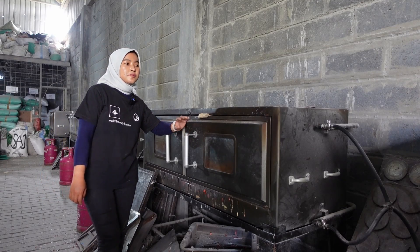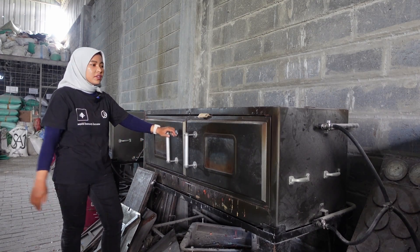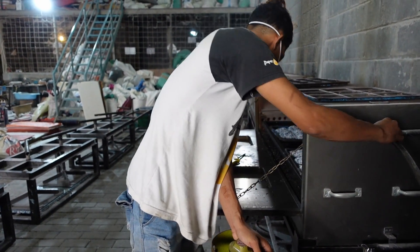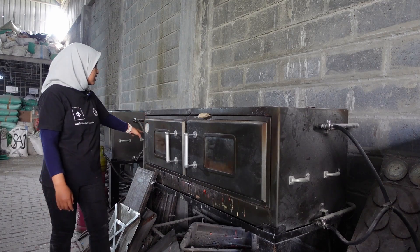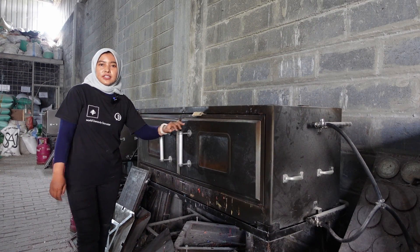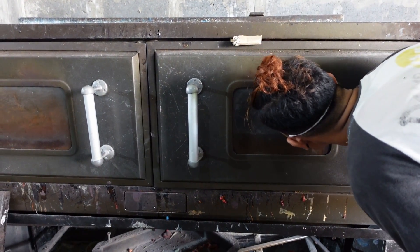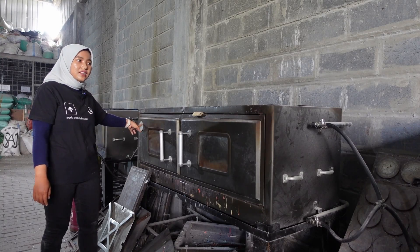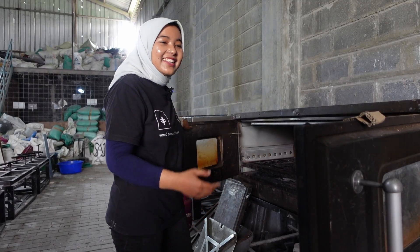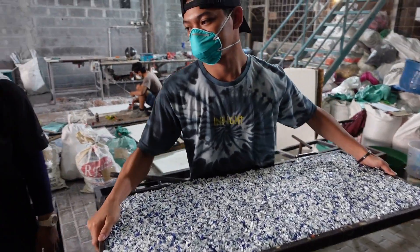In Robris we work with a bread oven. We put the molds inside — it uses gas so we control the temperature manually. We can see the temperature here. We use 150 degrees Celsius for LDPE type of plastic. However, because it's a manual oven, the temperature reads 150 but inside it's actually lower.